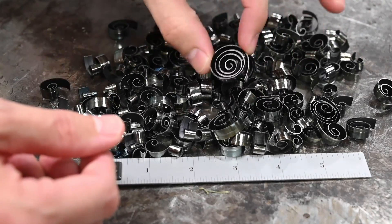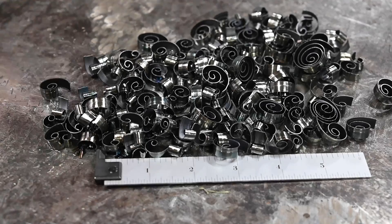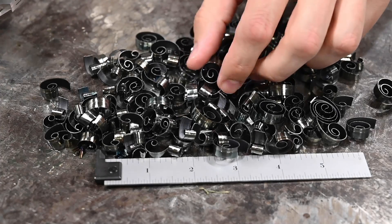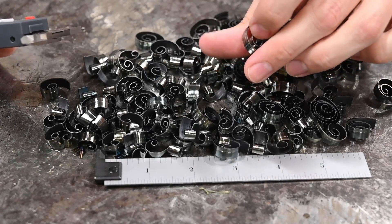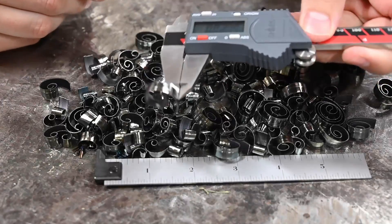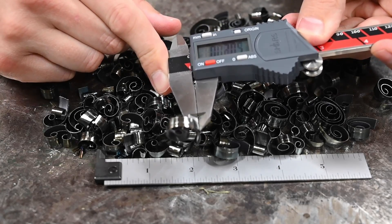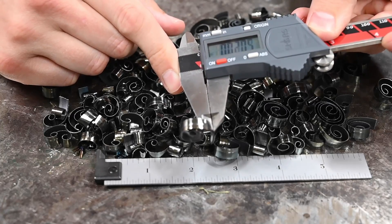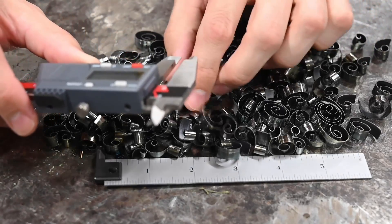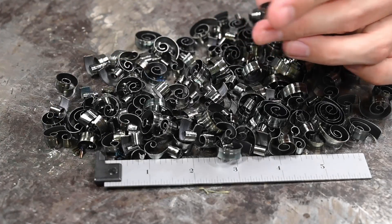This is 4140 in the annealed condition — non-heat-treated steel. The interesting thing, and maybe somebody out there has a comment for exactly why this is: I asked a buddy at work who's very knowledgeable on these kinds of things, and he wasn't sure either. The feed rate that I cut these at does not match the thickness of the chips. The feed rate was set to about 3.7 thou on these particular cuts, and yet the chips are 20 thou thick — mostly between about 17 and 21 thou. So they're thicker than the feed rate suggests.